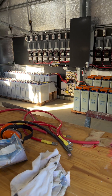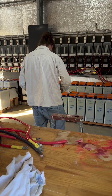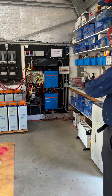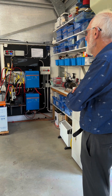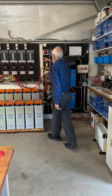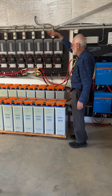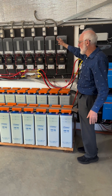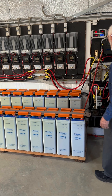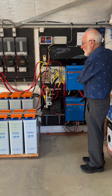It was made for shipping and so you can get this stuff, and so I decided to go with that. These things here are the charge controllers that take the power from the solar panels, which comes down at about 120 volts, and converts it and controls the charging of these batteries. And then these things convert the 24 volts back to 240 volts AC.